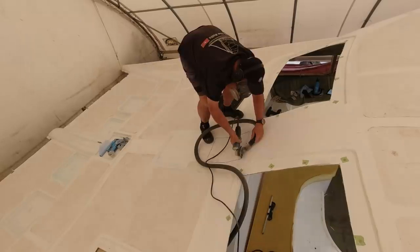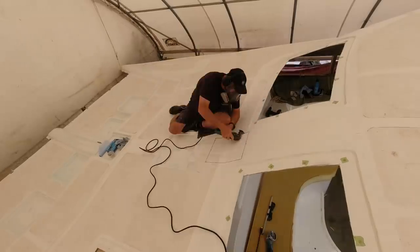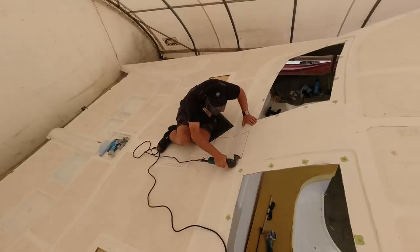Due to the thickness of the deck — around 40mm at this depth, being 25mm of foam plus solid glass laminate — I'd actually reinforced this area particularly strongly for the mast itself.